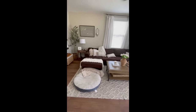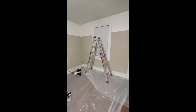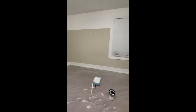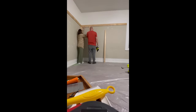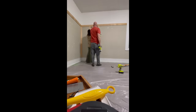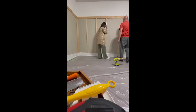And now for the rest of the living room — the fireplace pretty much prompted us to do the whole room. This is the before; I wasn't a big fan of the dark couch, it just made it feel really heavy. So we left the walls the same color but added a band of white all the way around the room at the top, about six feet high, with nine-foot ceilings. We added a picture rail all the way around in the center of that line, then added vertical pieces of wood every so often around the room.